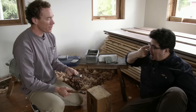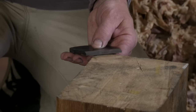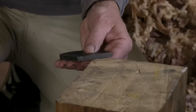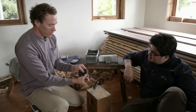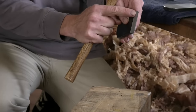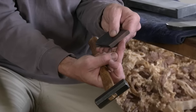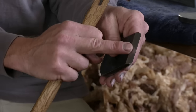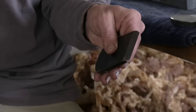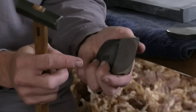I've got the courage, and really you can practice on a block of wood — you just need to be able to direct a hammer blow. These blades are constructed with a laminated construction: there's soft steel laminated on top to a thin piece of hard steel on the bottom, which is why the bottom is hollow ground. It's the soft steel that you want to deflect down, and that will push the hard steel down only where you need it.